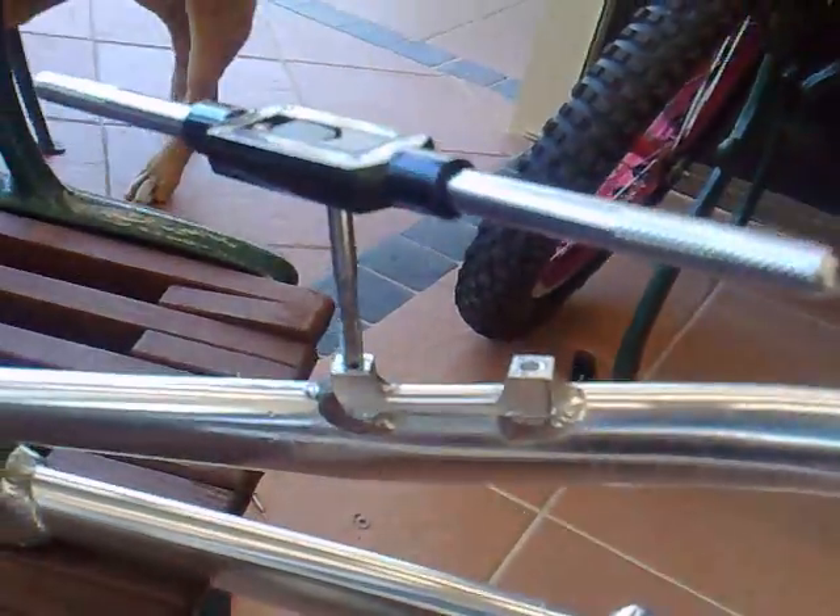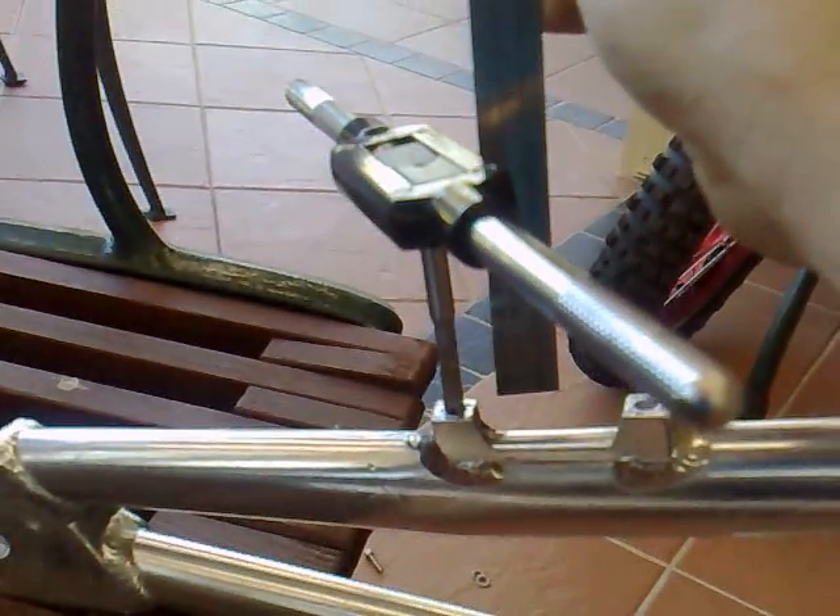Continue until the 10mm of the tap is exposed, which we worked out before. You also need to make sure you've got a good square edge on your tap — I just run a straight edge along the two mounts. Assuming this ruler is cut at a 90 degree angle, that is a straight tap. Okay, going again — tap it in. We're reaching the area where a new thread is being formed. You can feel resistance, give it a good turn, back it off and you'll see the metal filings coming out the top of the hole from the tap.